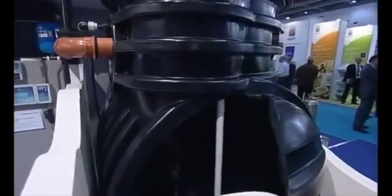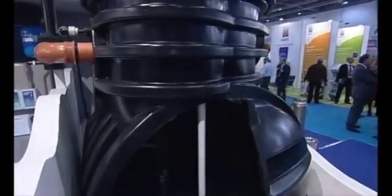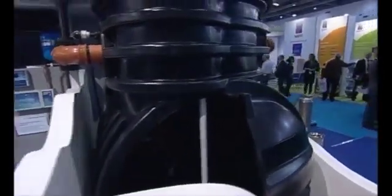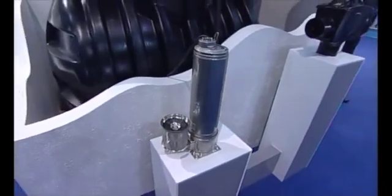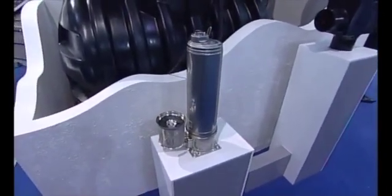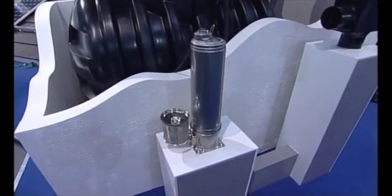We will provide pumps with the systems, and the pump will be inset into the tank. There'll be a leaf filter in the tank, so we'll take out all the leaf debris down to 400 microns. On the pump is another filter at 200 microns, and this is all to stop any muck that gets in there getting behind the ball valves.